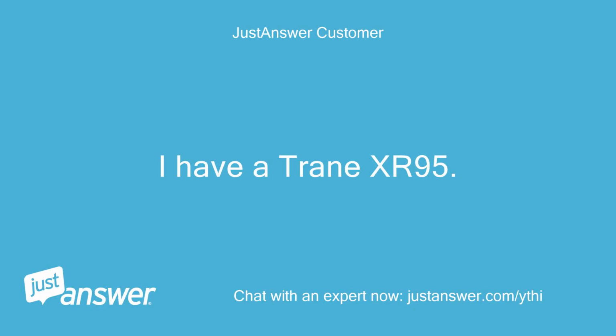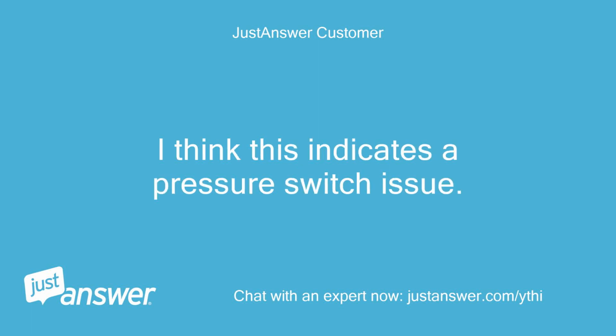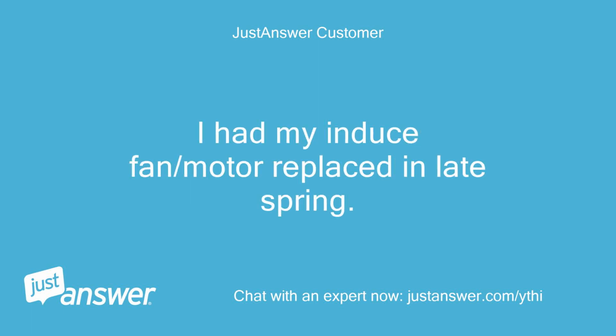I have a Trane XR95. I'm getting a flashing 3 red light error. I think this indicates a pressure switch issue. I had my induce fan/motor replaced in late spring.